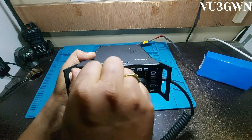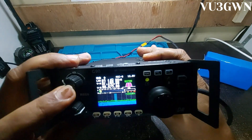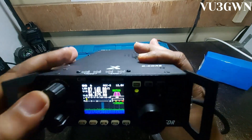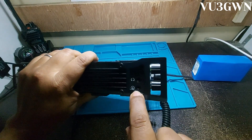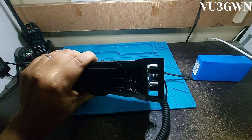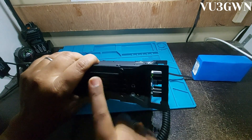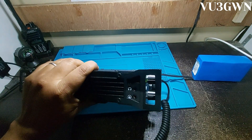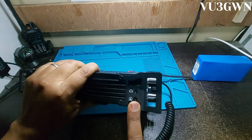This is the volume button — if you click it once it goes into headphone mode, so if you haven't connected a headphone you can quickly mute the radio and toggle back. The headphone jack is here. The bottom port is the COM port where you connect the USB cable that comes with the radio. The seller didn't pack it but is sending it separately — once I get it I'll make a short video on using the FTDI chipset to the 3.5mm TRS plug to upgrade the firmware.